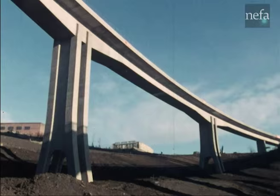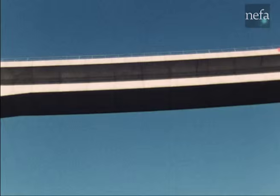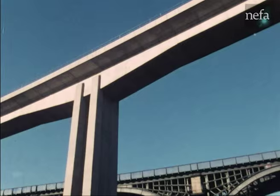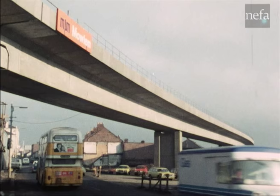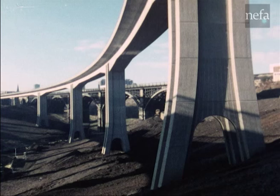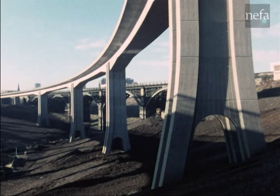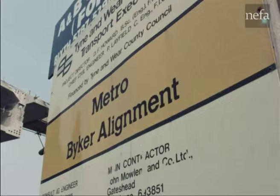As a pre-stressed segmental bridge, it merits attention as the first to be designed and built in the United Kingdom using the combination of cantilever construction and match-cast glued joints made with epoxy adhesive. Low-level continuous erection took the viaduct deck for nearly 500 metres across an urban area that includes two roads and a railway. The high-level section running over a deep valley in terrain with difficult access was built by the method of glued joints and cantilever construction. Many of the novel and technical features of the high-level erection are best explained by recalling key stages in the construction.